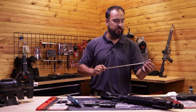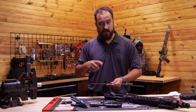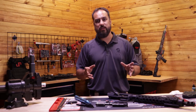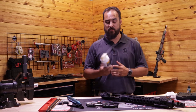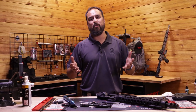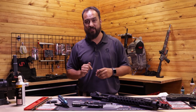If you chuck the rod up into the drill, put it in on medium, and go back and forth five times getting a full 360 degrees — this is something we've been doing in the shop for a long time. That will break down a lot of the buildup and gunk in the bore and clean out the area for the locking lugs. This is also a good time to use compressed air — whether from a can or an air compressor — to clean out the locking lugs. An air compressor probably works better, but either will do.